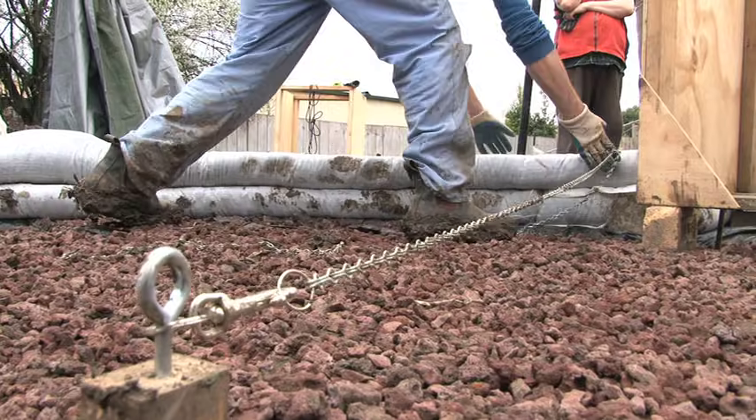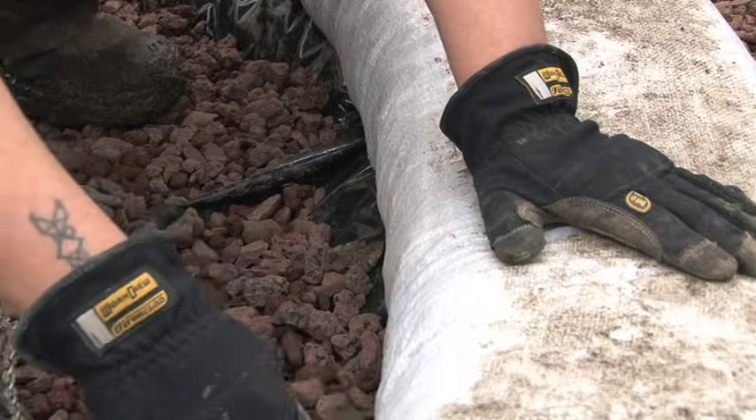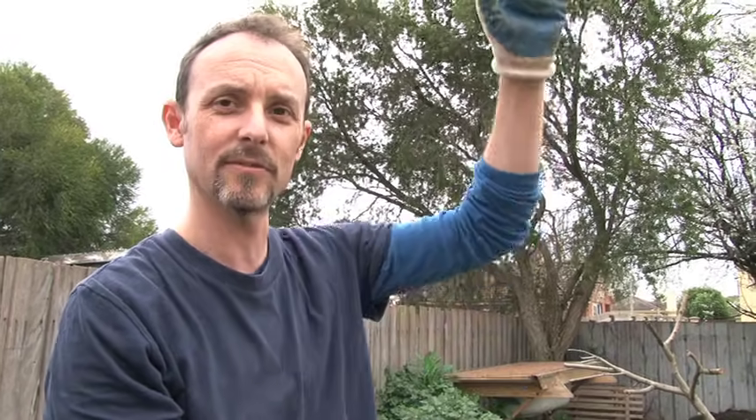Make sure that the ring is at the same distance all the way around so it's a perfect circle. As you go up you make the rings slowly smaller and smaller, and so it forms a perfect dome.